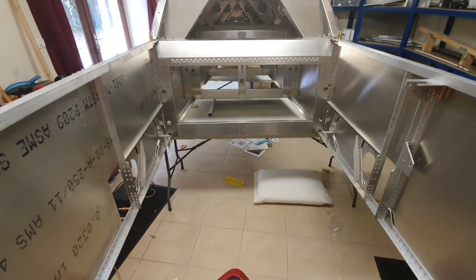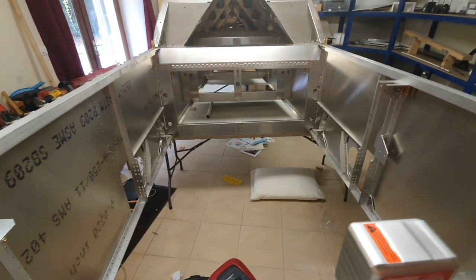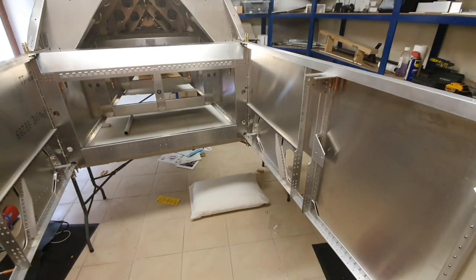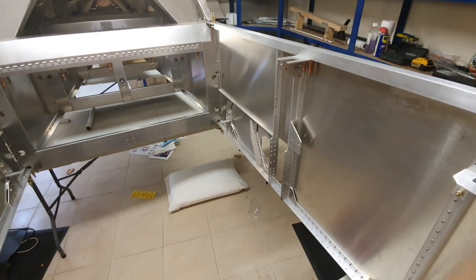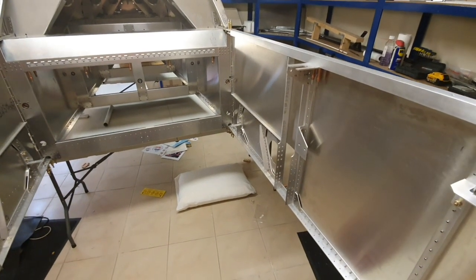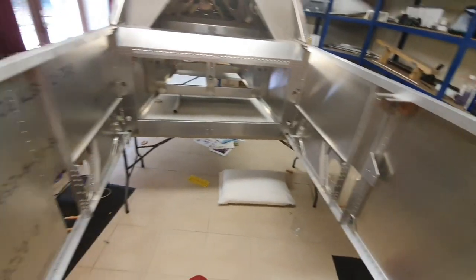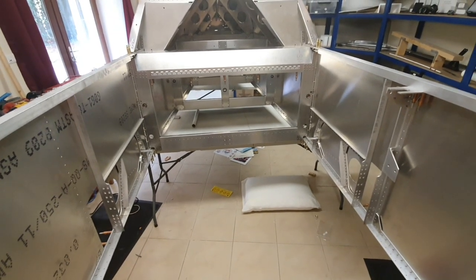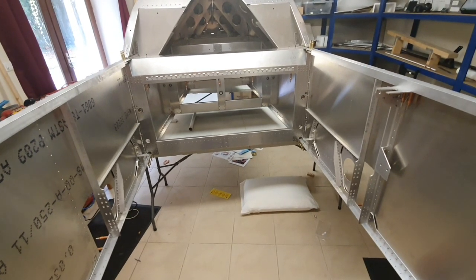What I'm intending to do is start constructing from the aft end of the forward fuselage forwards. I'll have a look at all my bits and pieces — I'll probably have to take the seat straps off the sides because I can't get the bit that runs across the back of the seat in with them in position. I'll get that clicked into place and then put some rivets in.